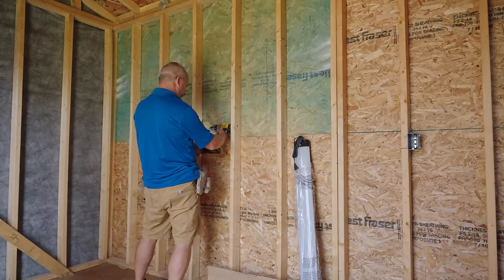So, all we gotta do here, take our wire strippers, and on the wire stripper it has numbers. It tells you what size of wire you're using, okay? So you put that wire that says 14 in the 14 spot, and you go like that. That's it. It's not tricky, okay? If your tool stops working, just go buy a new one. It's not worth it to sit here fussing around all day long.